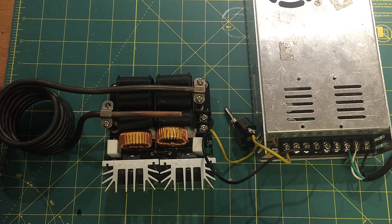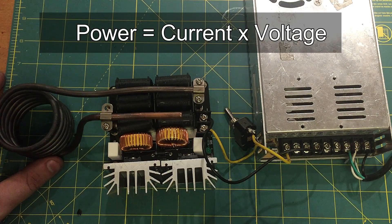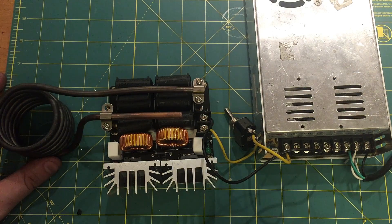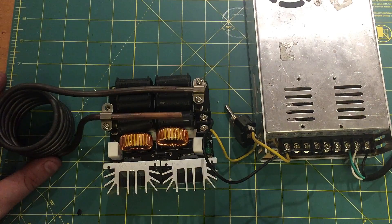This unit is actually quite powerful. It says it goes up to one kilowatt — I'm not sure if I totally believe that. Let's see: 20 amps, 50 volts — yeah, a thousand watts I guess. It's rated 20 amps, 50 volts. I'm using 48 volts right now at 7.8 amps, which I thought would give me a pretty good factor of safety.